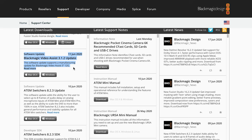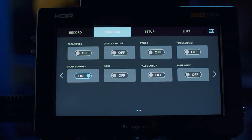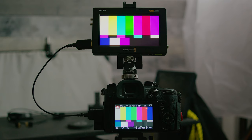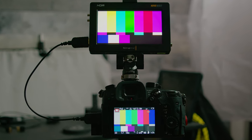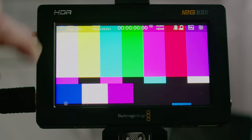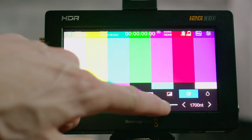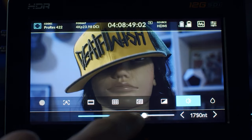The main downside to me about the 12G HDR Video Assist is that there is no real way to calibrate this thing. Blackmagic Design seemed to think that because it's HDR and DCI-P3 it doesn't really need color calibrating, and I just find that bizarre. I don't like that I can't go in there and manually adjust the white balance of the monitor, I can't change the hue, and I can't change the tint either. However, you do have the ability to adjust both the saturation and the contrast. So what I did is I imported the color bars off of the GH5 onto the HDR Video Assist and was able to do a poor man's color calibration by adjusting saturation and contrast in conjunction with brightness. The contrast I have set to 74%, the saturation at 63%, and I've found that the monitor looks the best when it's at 1000 nits.